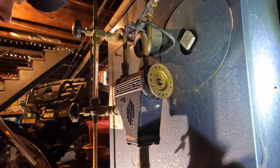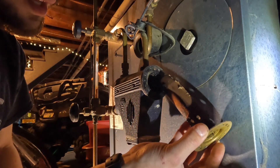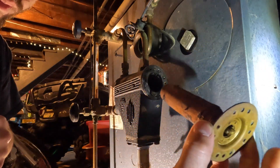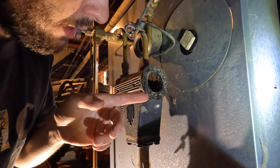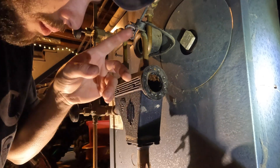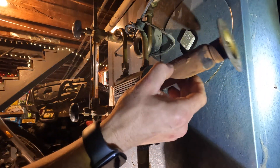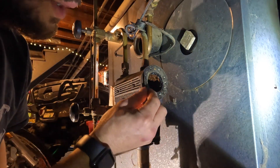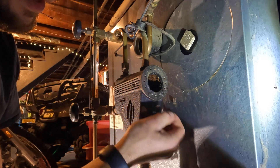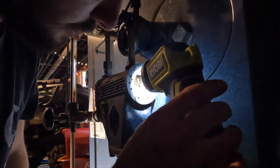The float is very heavy and there's water in there. Here's your gasket — you're going to want to take this off and clean around it really well; rubbing alcohol is your friend here. If you need to scrape, do it. There's a hole here but it seems to be holding water in — maybe it's a pinhole. There's quite a bit of corrosion in there, so I'm going to try to loosen some of that up and flush it out.